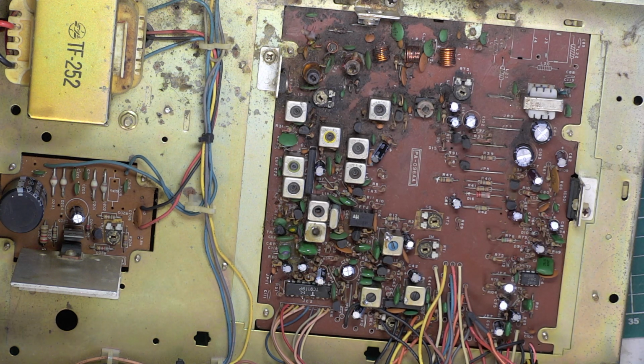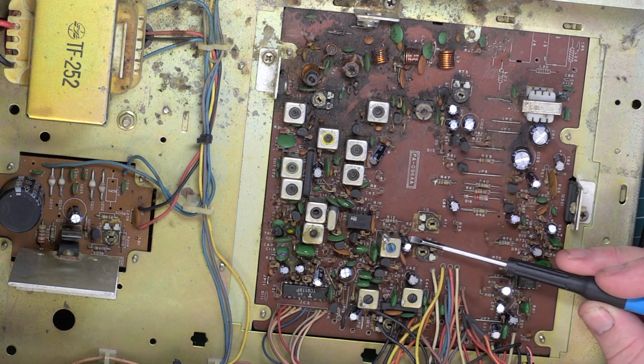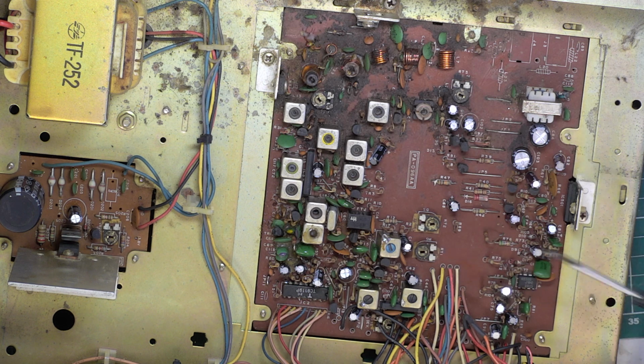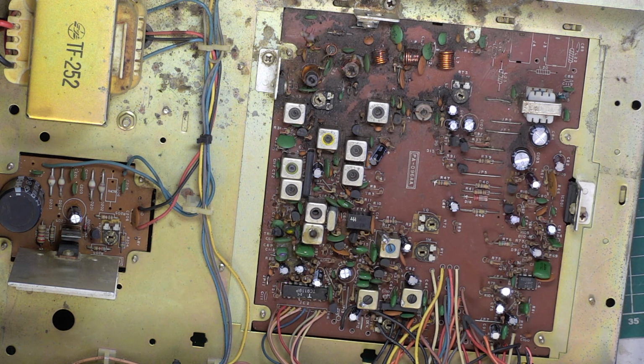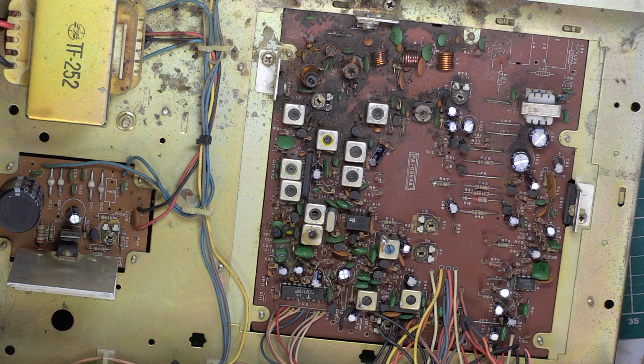And the big coil which made a difference when I've just done a quick retune is this coil, which means that capacitor must have been well out of spec. Out of those I changed. It sounds better. So all these ones around the audio amplifier, an improvement. Let's see if we can get anything better on transmit. Oh, I can actually hear. Yeah, I can hear 0.25 of a microvolt now, and before I could hear 0.8, so that's the best I could possibly hear for getting instrument readings, and now I can hear there. So it's made a big difference.